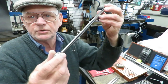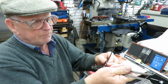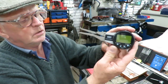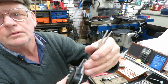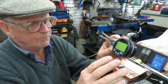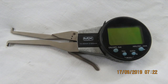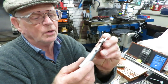The standard type — most of these ones I have are Moore and Wright. It's a standard type, a larger one. I have a very big one behind me here that I use very rarely. Then you also have the digital style internal groove caliper. This will work with imperial or metric, whichever you want, and you can also connect it to a computer.